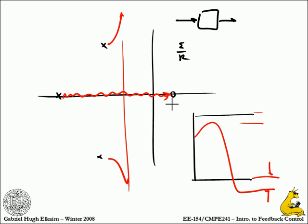So this is one of those things where you get more and more comfortable with it as you start sort of plotting them all out, and you're like, ooh, putting a 0 in the right half plane does strange things, right? And that's one of those things that you're just going to have to get used to. Now, we're going to go back and we're going to look at my various compensators. All right. So this is one of those things where, let's say I have my system.